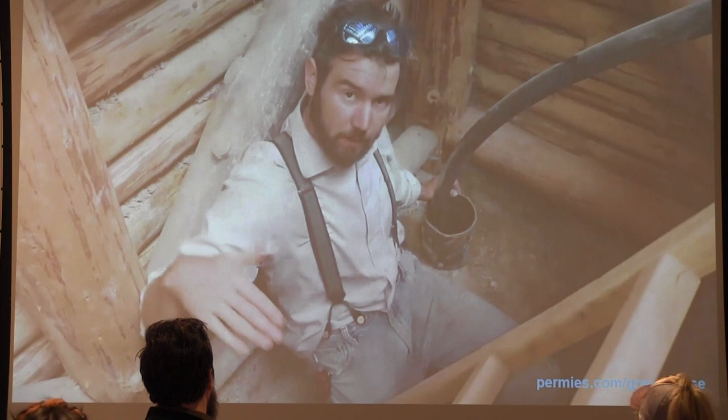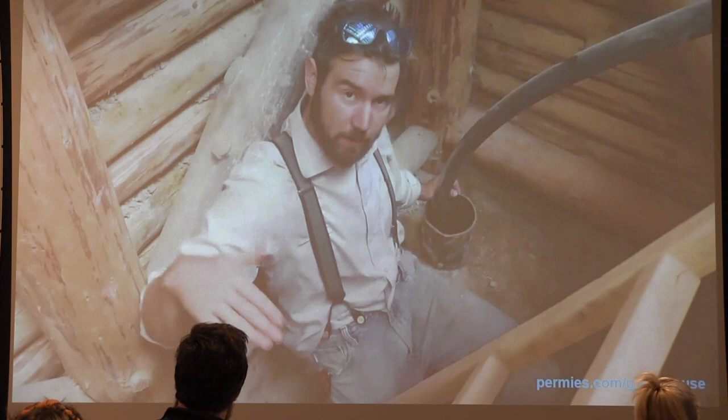Yeah. So in this particular spot, we have gone onto this property many times, and we've dug holes as deep as like 24 to 40 feet deep. And so we've got these really beautiful, deep alluvial soils that just seem to go forever. So when we were digging down, we encountered some clay. We had a clay layer, but then we got back down below that. There was more gravel and sand. So this whole thing is being placed in someplace where any water that gets into this well casing will go down onto gravel and sand and then disappear.